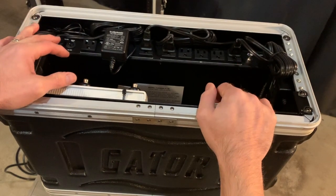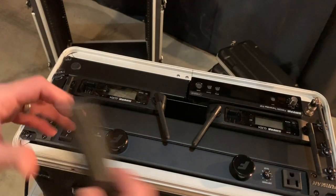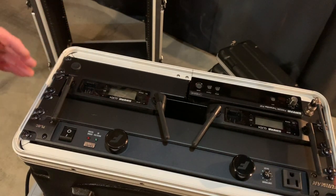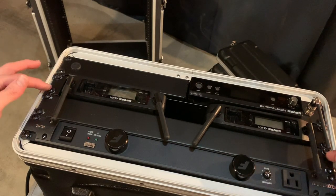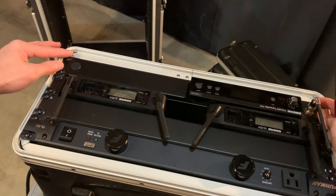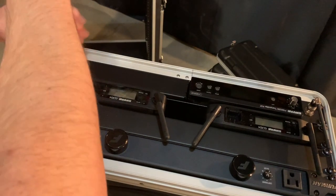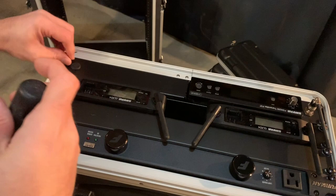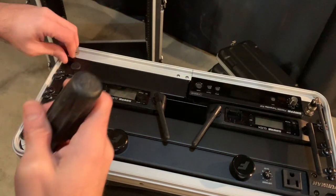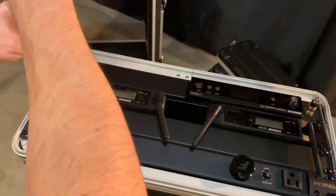But all this is coming out, so I just kind of have to disconnect back here and then get ready to go. Whenever you're putting gear into or taking gear out of a rack, if you set it so that the items hang vertically, then you're not putting any strain on the lips that hang over the edges here and hold the units in. You can get them seated evenly with all 4 screws, so there's not extra strain being put on anywhere. It's something I always do. Also, I never use a drill screwdriver on these, because if you end up stripping these holes out, you're kind of screwed. You got to get a whole new rail. And in some cases, the rail's built into the rack, and then you're doubly screwed, because you got to get a whole new rack.